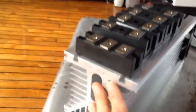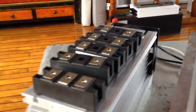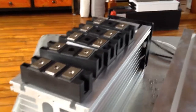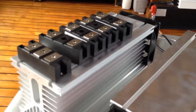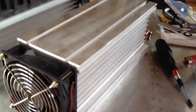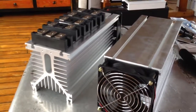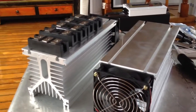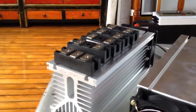Because they produce heat — especially if you've got a 120-foot yacht, you're going to be able to produce a lot of power, a lot of panels — that's what I've had these made for. I've got some smaller ones for the smaller boats, like what I use on my boats. But that is the heat sink with the fan for the blocking diodes.